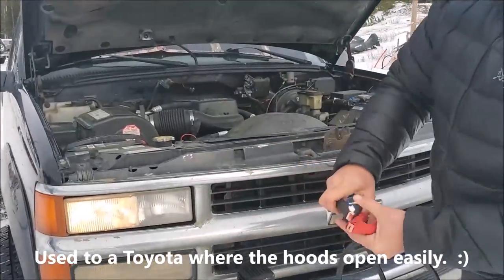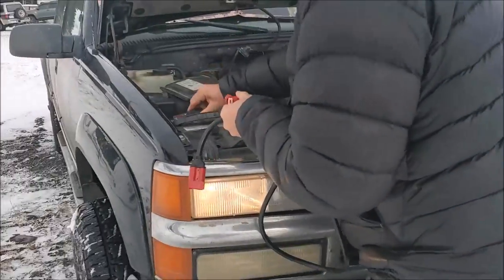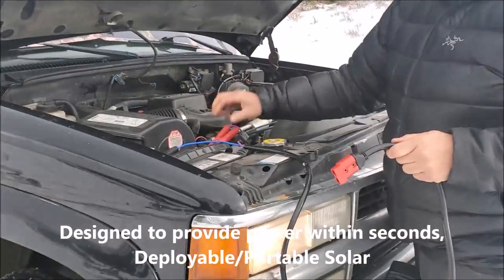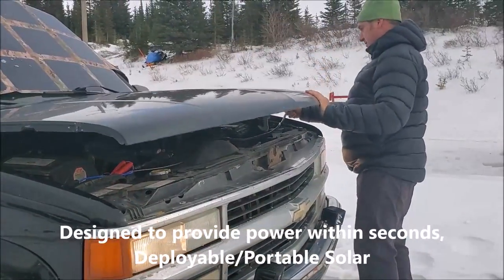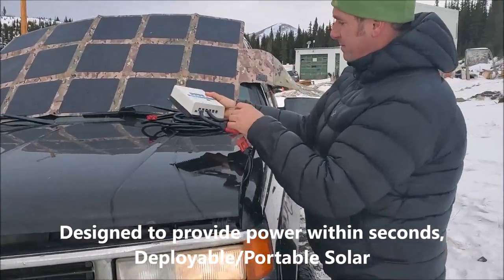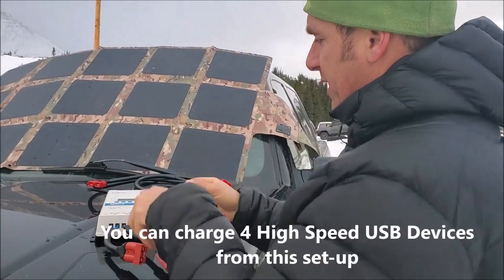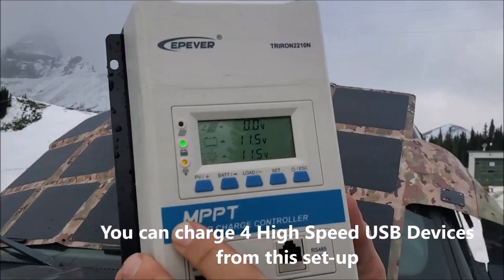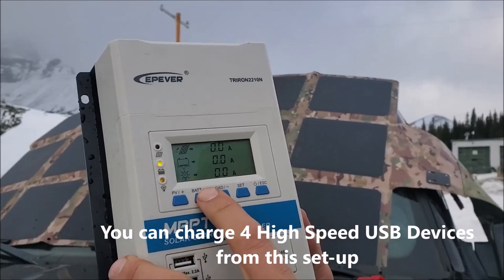It's pretty simple how this all attaches. You've got your positive, your negative — get the snow off of that. And this has a standard 30 amp fuse as well. It's pretty windy here right now, guys. We connect that to the smart solar charge controller, and you can see it automatically detects the battery — it's going to know if it's 12 or 24 volt, and if it's a lithium battery, it is programmable for that.